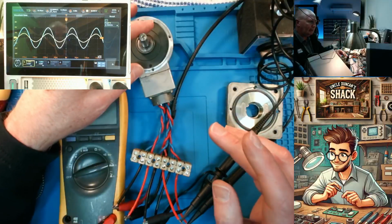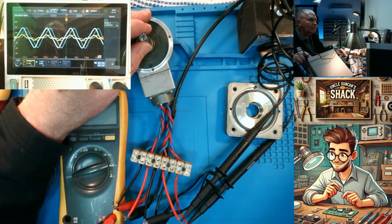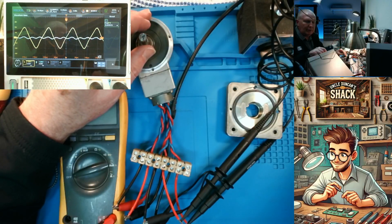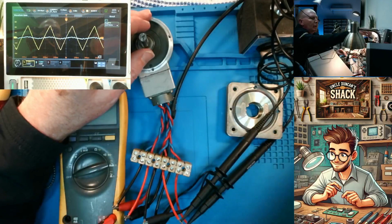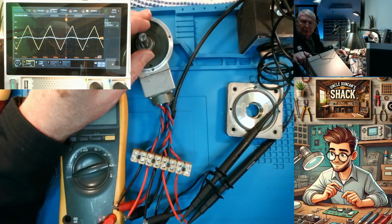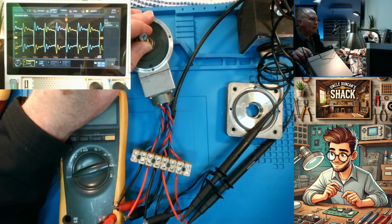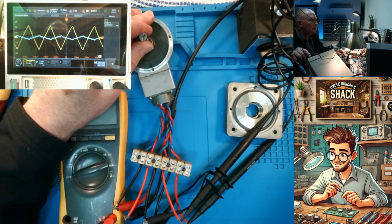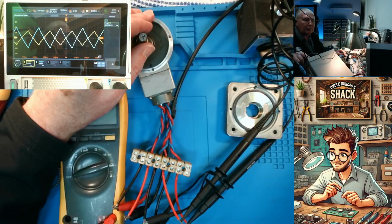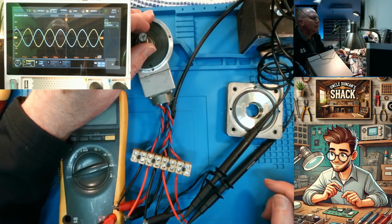Right, so it has an AC source powering it, so you need to supply it with power. So if I change the signal generator's output to a triangular wave, let's slow it down a little bit, like that. Let's go to square wave. You can see that appear on the output as well. Now obviously this is designed to work with a sine wave, so you're getting a bit of distortion when you're not applying a pure sine wave. So we go back to pure sine wave and it looks like that.